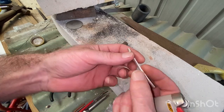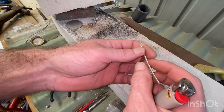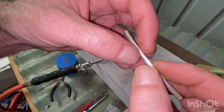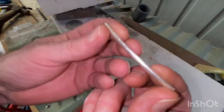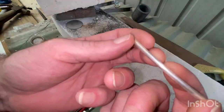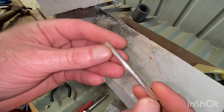Just be careful you don't start splitting the outside on thicker stuff when you stretch it too much. Once you bunch up the inside, stretch out the outside, you anneal it again, and then that'll rearrange those molecules in that new shape and relax the molecules even again. Then you can bend it some more without it bunching up more. It's now just bunching up again. That's all I can explain on the nature of this.